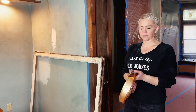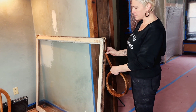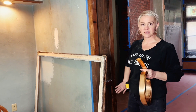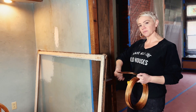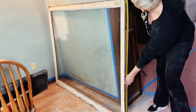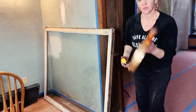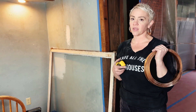So we can put the spring bronze weather stripping on the side here. This is spring bronze weather stripping. When you go to do your windows, you want to measure the width of your sash and find the appropriate width for your weather stripping — I'll send you a link in the comments section. The point of this is to seal the window against incoming breezes, wind, weather, etc. Once it's on, we'll score this edge — it'll make a flange that presses against the window and keeps it nice and tight. So we're going to measure the length of the window. From bottom of the sash to the top is 51 and a half inches. We'll take our spring bronze, go back over to the opening and attach it — you can either use penny nails or a staple gun, and I'll show you both.